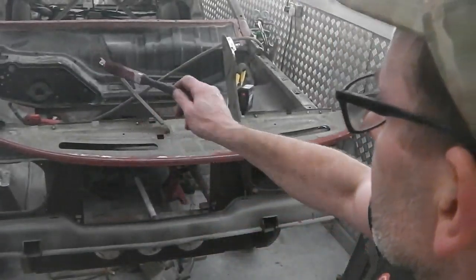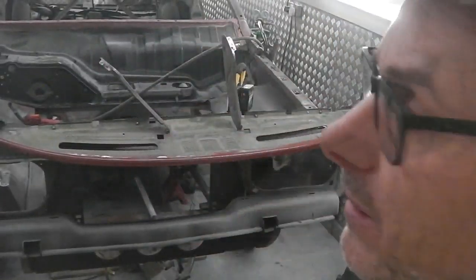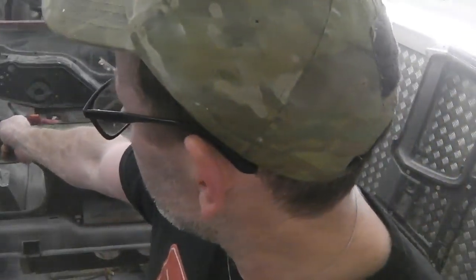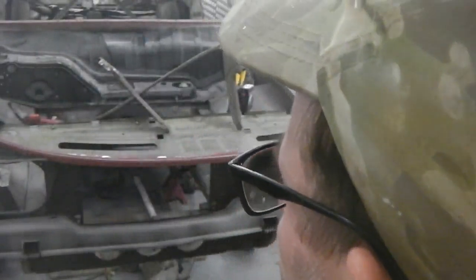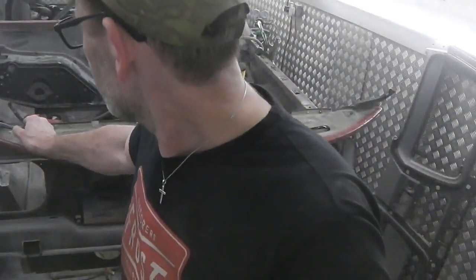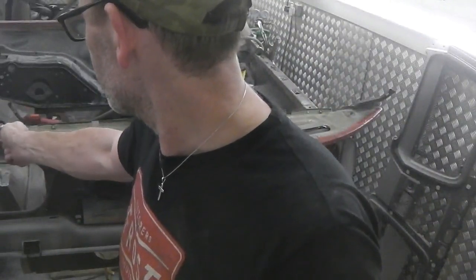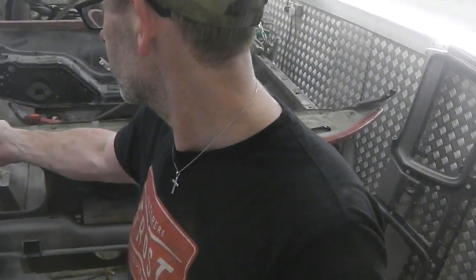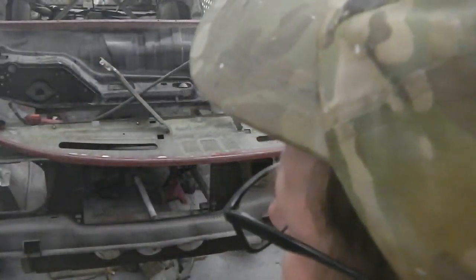Yeah, so let's get that panel in at the back, then these have to be welded to just where the A-pillar area is. So that's a MIG job, no way spot welder goes in there. I've just spotted where we spot welded that new bracket on the side.